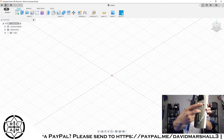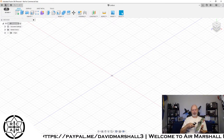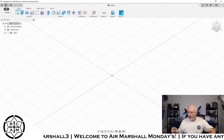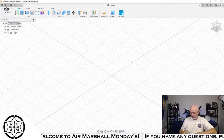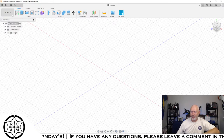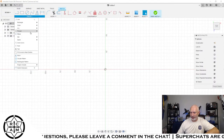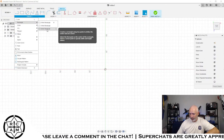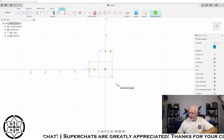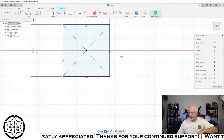But I want that mount to be the same width as these two things, and that is right at 24 millimeters. So again, for simplicity, I'm going to create a sketch right here, and I'm going to do another rectangle. It's 24 by 24. All right, so we're just going to make a 24 by 24 square.